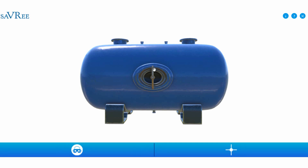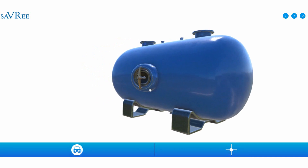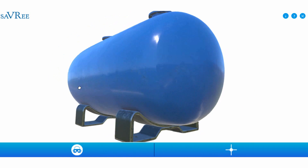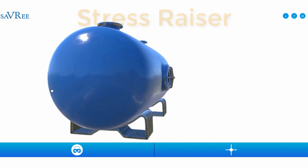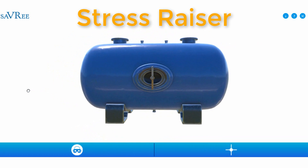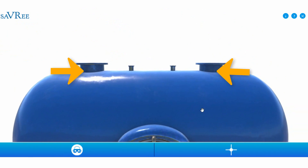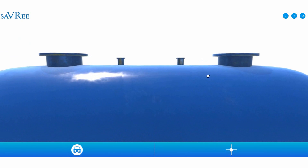As you can see, it's cylindrical in shape with no sharp edges. The reason there are no sharp edges is because this pressure vessel holds pressure and we don't want any stress raisers — areas in the tank where stress is gonna be higher on the material than in another area. Stress raisers do exist where pipes are installed; around the base of the pipes they represent areas of higher stress.